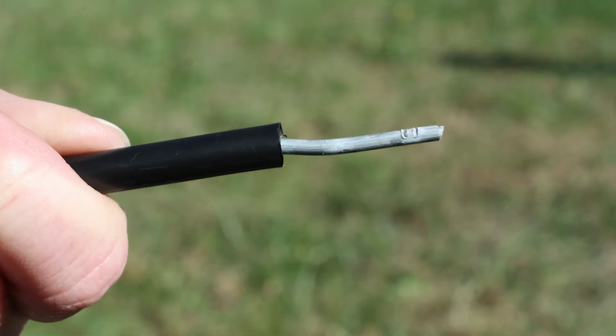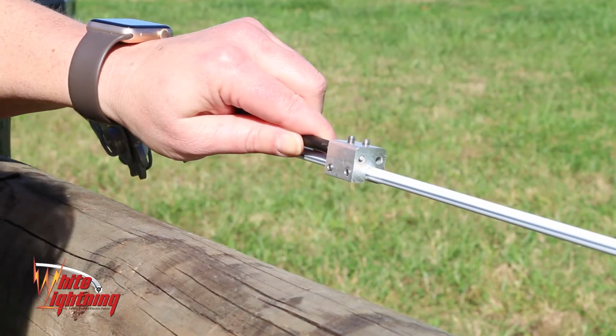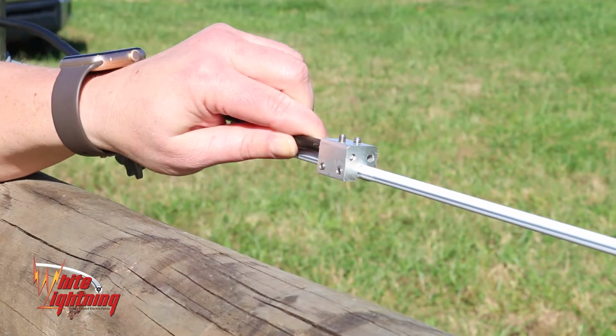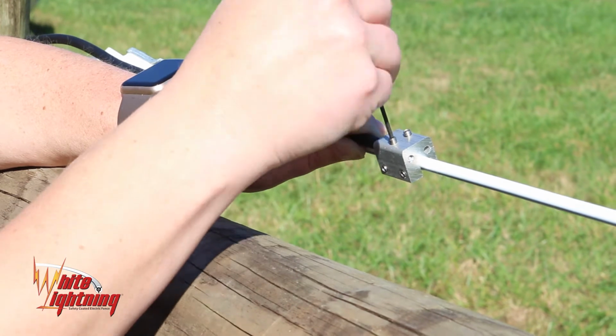Prepare the undergate cable by carefully removing 1 inch of polymer coating to expose the bare wire. Using the Allen key, back the preset screw out slightly and insert the bare wire into the Stinger channel. Securely tighten the top screw using the Allen key.